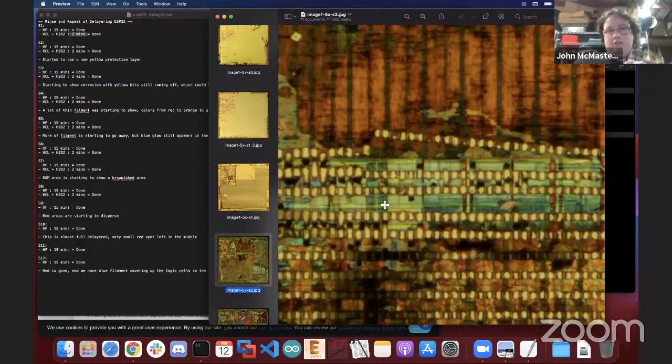So one of the reasons why I suggested this was possibly a barrier is because you're using a very aggressive etching solution. I don't know exactly your concentrations; I'd have to double check. I think even still that should have etched, if that was, say, aluminum, for example, or even copper, that would have etched very quickly. It's very thin, and so it should have etched metal like that. But the fact that it was still there and it has a yellowish tinge, I was thinking that instead that's one of these so-called barriers that are used in certain metal layers on chips that would have been relatively inert to these acid etching solutions.